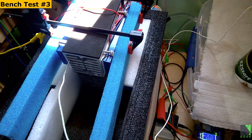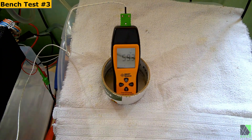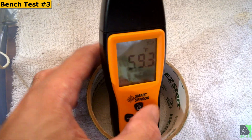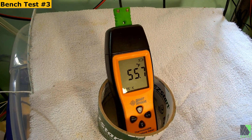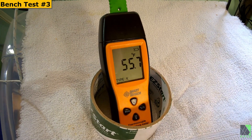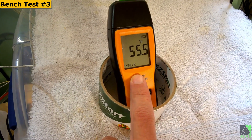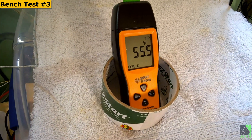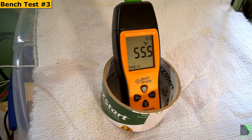Let's see how cold that air is. With my thermocouple in there, we're looking at about 59 degrees Fahrenheit, that's 15.2 degrees C, but I'd really like to see better than that. On the bottom bank of eight Peltier elements, we're looking at about 55 degrees on the outlet air, which is pretty good. However it's a little bit deceptive because it doesn't tell the whole story — a 55 degree air outlet just means there's a certain amount of air flowing over the heat sink. It doesn't really measure cooling power at all, and this is a common misunderstanding. However, that air is nice and cold coming out — it approaches what a normal air conditioner would put out.